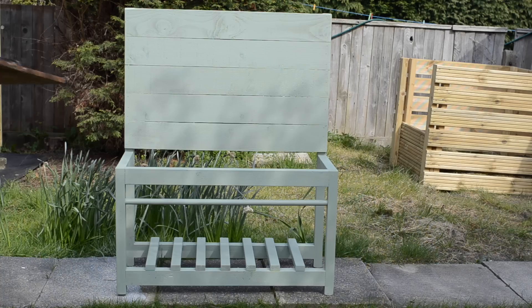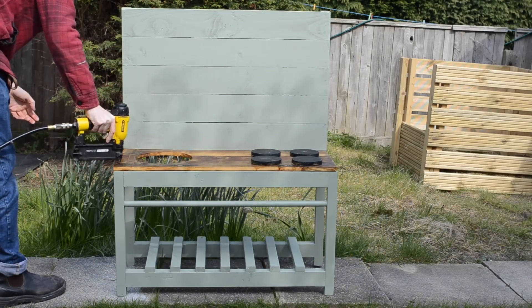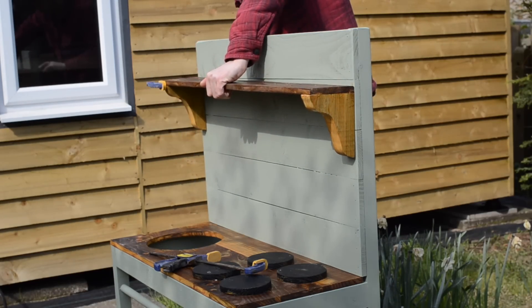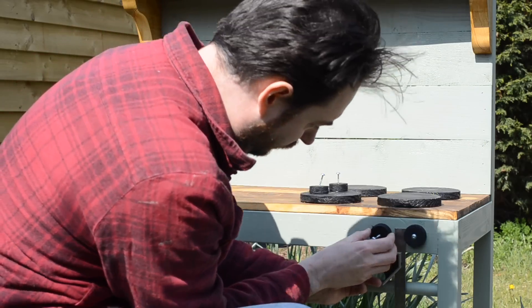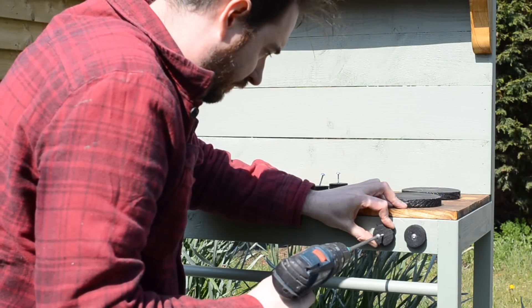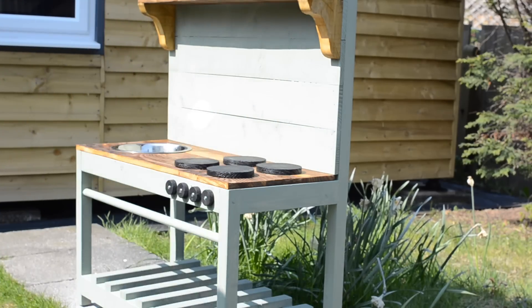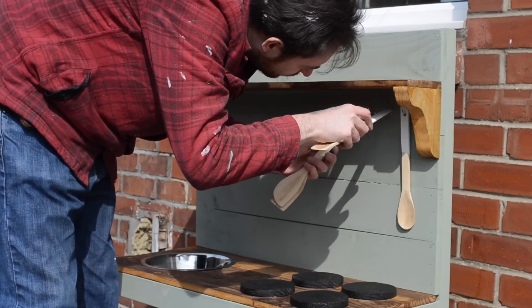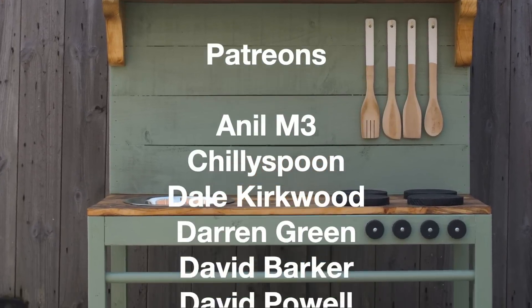I leave the oil overnight to dry and then I can get the countertop installed. I actually put some construction adhesive underneath it, then got a few brad nails just to help hold it in place until it went off. I position the shelf above the stove and sink, get it clamped in the position I want, and then drive some screws through the back to secure it. The knobs for the stove can then get screwed on the front — I'm using pocket hole screws as they've got nice pan head tops. I drop the sink in place, and then I can add some other accessories: four brass hooks along the back. The last job is to stick some utensils on, and that's it all done. Thanks for watching, thanks to my Patreons, and please subscribe for more videos.